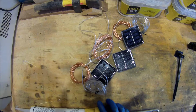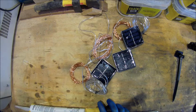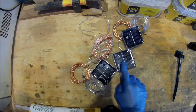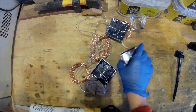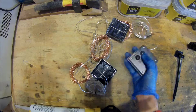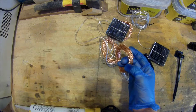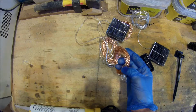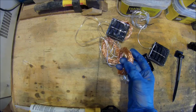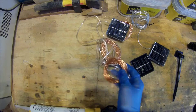Okay, so I really like solar lights. Now, I bought a load for the garden last year, and nearly all of them succumbed to the weather. Despite the fact they say waterproof, what I found is that the actual solar panel units themselves are normally absolutely fine, despite having quite poor waterproofing. It's normally the wiring where water ingress gets into the LEDs and rusts the legs on the LEDs themselves, which then detach from the one-strand-thick copper wiring that feeds the power to them.